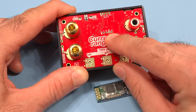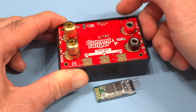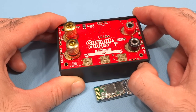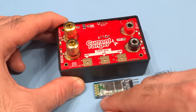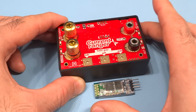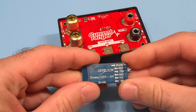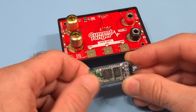Another optional header is a four-pin connector for attaching Bluetooth serial modules for data logging. Data logging through USB is possible, but most power supplies have switching noise that degrades the output signal. For cleaner, smoother data logging, you would use a Bluetooth module unaffected by wiring or switching noise. This header is designed to match the pin order of the HC06 Bluetooth serial module — a very well-supported, commonly available module with a data rate up to 2 Mbit/s.